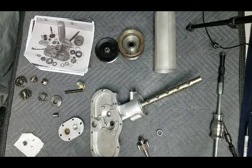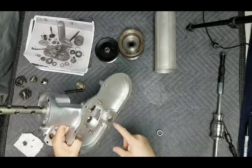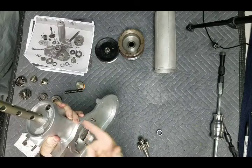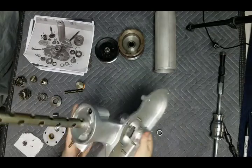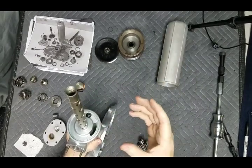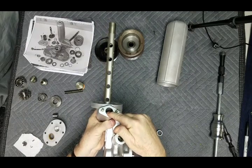With that said, let's talk about how the oil pump works — how the oil flows. We get the oil from the pickup, from the pan, comes in through here, and then we have the oil right here. These gears are moving to push the oil up into the filter area. On this side you can see we have a channel — goes up in here, it goes around the outer part of the filter. You have the case on it, and then it is pushed through these holes and through here. This is the outlet that goes to the block so that you can put the oil into the bearings and chains.